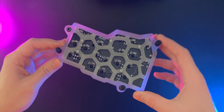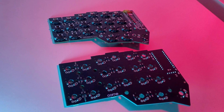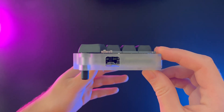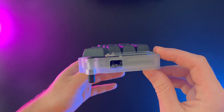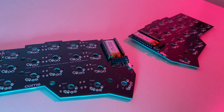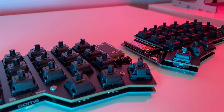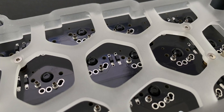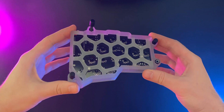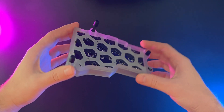Starting with the PCBs, you can see there's no more hot glue needed for the power switch, which is now cleanly mounted to the PCB in a much more accessible location. For a cleaner look, we also decided to skip the battery connector and instead tuck the battery and wiring underneath the nice!nano controller. The key switches are still hot-swappable, but this time milimax sockets were needed due to this particular PCB design. Be advised that if you have 5-pin switches, you will need to modify them to 3-pin switches with a pair of flush cutters.